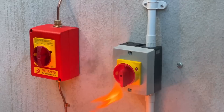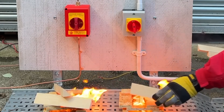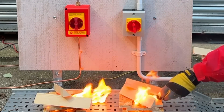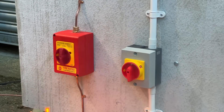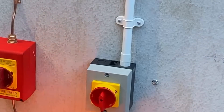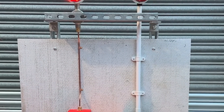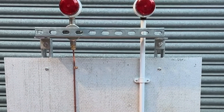The next stage requires a responsible adult, and we didn't have any of those at Lineside Studio, so Gordon stepped forward. On my side of the rig I've got that plastic isolator, 20mm PVC conduit, and within that 2.5mm² PVC singles going all the way up to my flashing beacon. We've got the same flashing beacon on both sides — we'll see which one fails first.